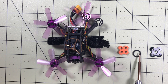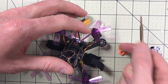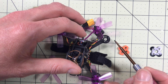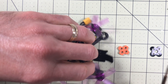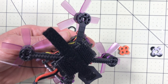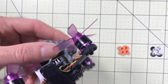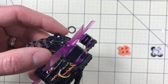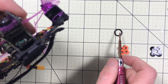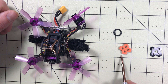The O-ring still works very well. One of the added benefits is that it doesn't quite fit across the gap - it's just a little small, so it applies sideways pressure against the screw. Because of that, even though I've not loctited these and they're not tied down all the way, I've not had a single screw even come loose yet - all 16 of them are exactly where I left them in that very first video. I have to think that this pressure of the rubber has helped with that, and I don't think you'll get that benefit with either one of these other options.